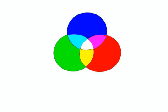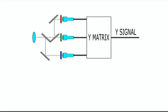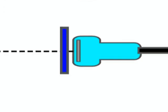In order to make the explanation easier, we will start by saying that white light is a mixture of three primary colors: 30% red, 59% green, and 11% blue. The camera used for color television has three black and white image capturing devices — the first one has a red filter, the second a green filter, and the third a blue filter.